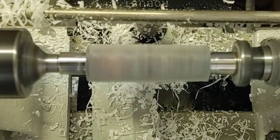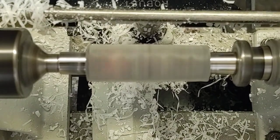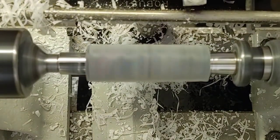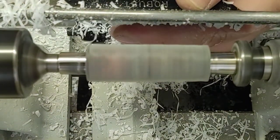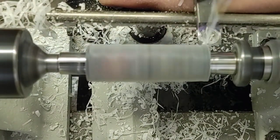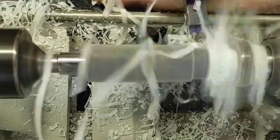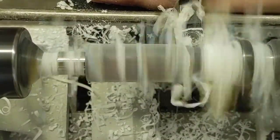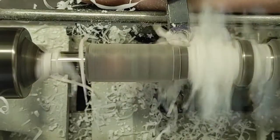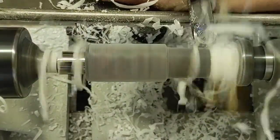See those ribbons that we've got coming off on there? Or you can just go back and do your plunge cuts with your EasyWood Tools R2 negative rake. This is my preferred method — it just seems faster, a little more controlled, straight back and forth. I almost never worry about catches.